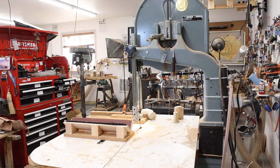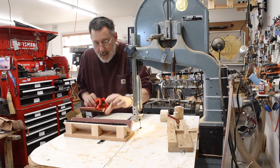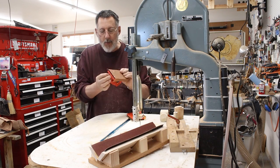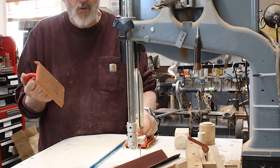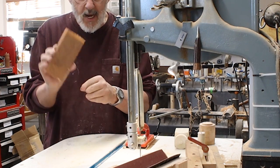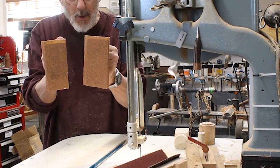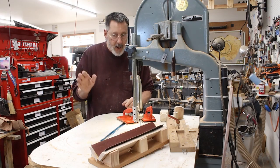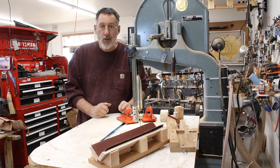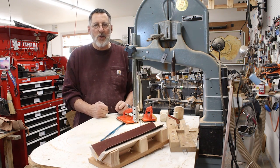Here's another tip. As I was making this video, I was using my jointer. I've got these push blocks that have rubber on the bottom of them, and they don't hold very well — they still slip. I always line the bottom of these with the coarsest grit sandpaper I can get. Here's some 60-grit sandpaper, and boy, it makes a big difference when you're running through there. Please subscribe to my channel — it means a lot. Share my videos if they're useful for you, because they're probably useful for somebody else. This is the first video I'm working on in 2023. Thank you for watching.